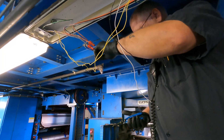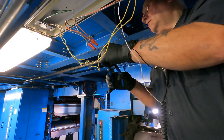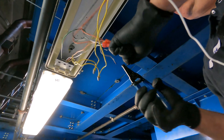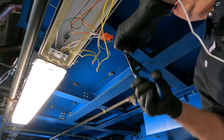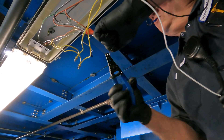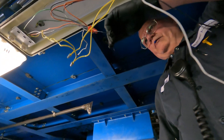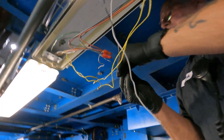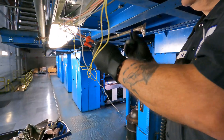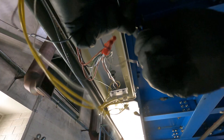You need good insulated ones. It's 277 volts — got to make sure you don't touch it, no matter what. It's going to be a stubborn one. If you want to strip, you don't let go of it either — you got to control it. The other side's already stripped, so that's not a problem. The last one you strip is your hot wire. I always push it on the wire, push them together, and then twist it, so I know I didn't miss one.